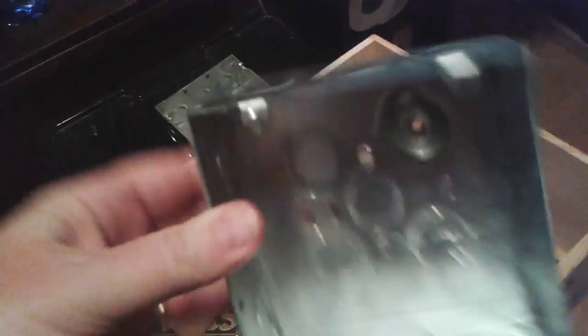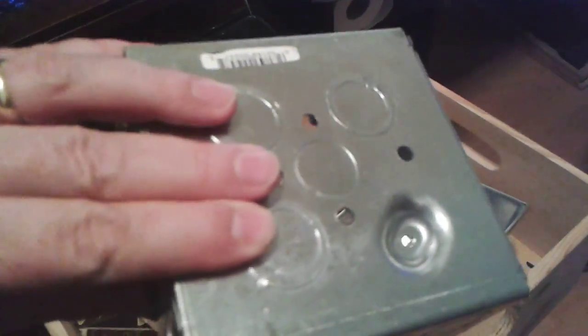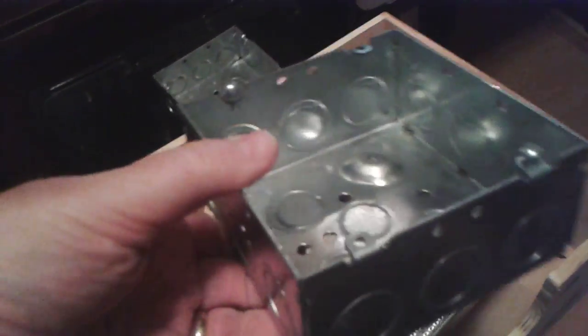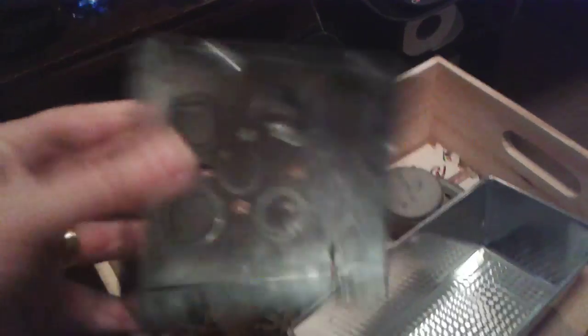You can use junction boxes. I've used plastic junction boxes, like they have here in Europe, which you can see this Compactron tube mounted on. Or I prefer the ones they sell in the States — these kind of galvanized ones. They're really sturdy and really easy to work with, and you can easily get a few tubes in there, depending which way you want to stick them. They're also easier to ground, and there are many applications if you're creative.